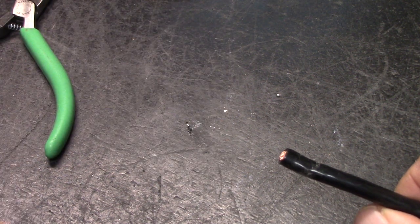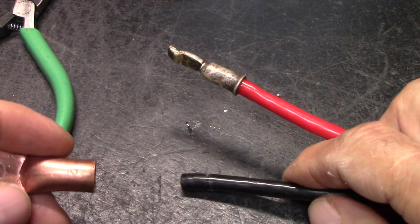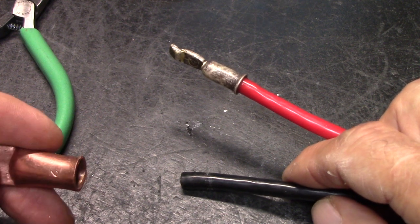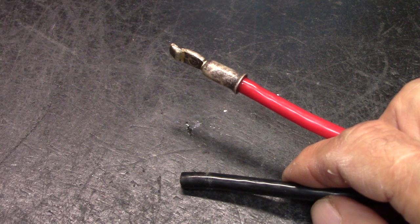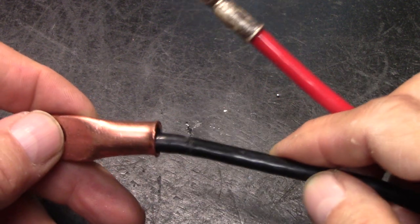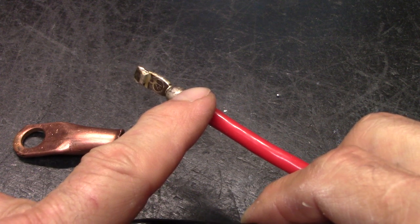Right there. So anyways, now, if you use some cheese-ass junk, Taiwanese, nothing against Taiwanese people either, but a lot of stuff made in the United States is good stuff, it's good merchandise, good materials, so stick with it. Radio Shack makes decent solder, and if you want to spend the money, get Kester, take your pick. Alright, so now, if you have a whole shitload of solder in there, and you didn't tin it the way I showed you, remember, I'm going to put a link to another video.